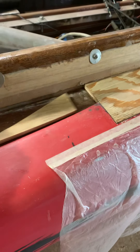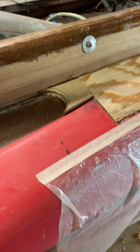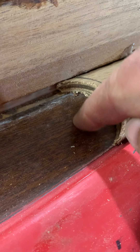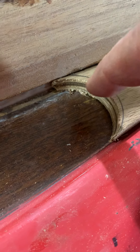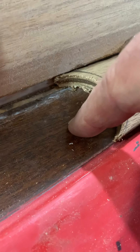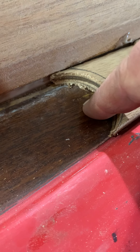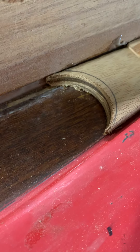One other option would be to actually install a piece like that and put a drain. I could do a copper flare on a half-inch copper tubing, countersink that, and put it right down at the surface. Anything caught up here would then go down the drain into the bilge, and you've got a bilge pump so it can be taken care of.